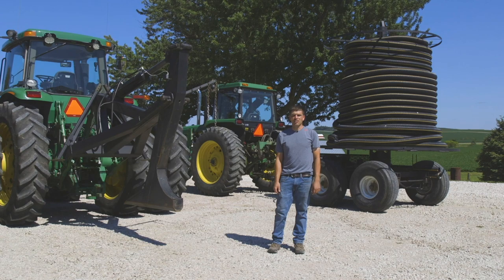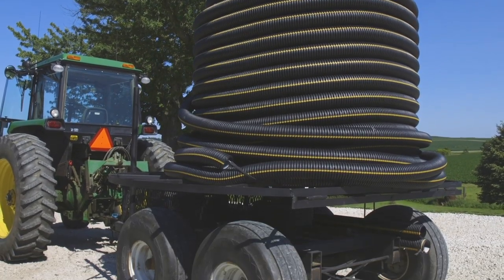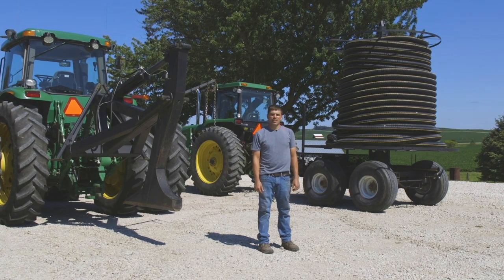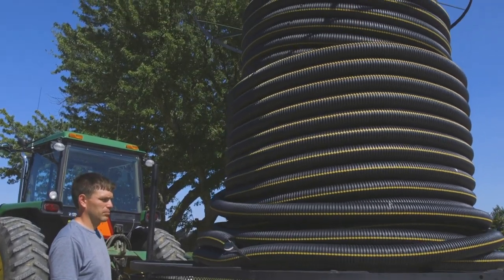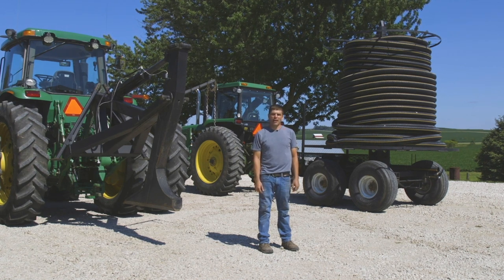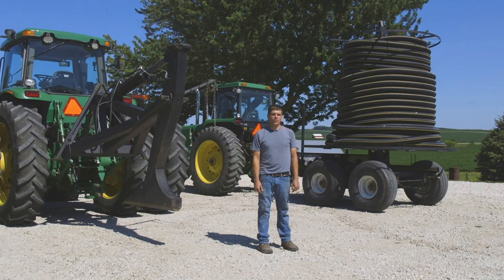Over here I have the tile stringer cart, and I started with the frame of a fertilizer spreader and built off of that. The main pivot that the spool rotates on is half of a semi-trailer axle, so it's strong enough to support the weight, and it also has the brake drum and brake pads intact, and that's how I limit how fast the table turns, is with a hydraulic cylinder hooked to an arm that actuates the semi-trailer brakes.